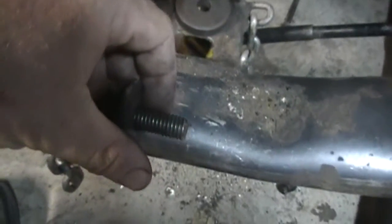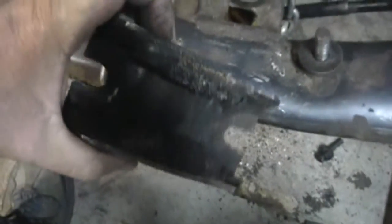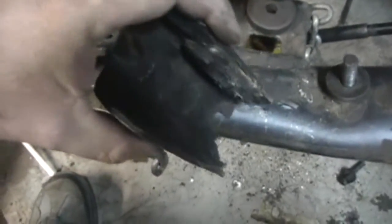The stock stud is less than a half inch diameter, but I go to a half-inch diameter button bolt and weld the nut to the inside. Basically all I do is take a torch and a putty knife, heat that up and pick it out. Or if you're sitting around the bonfire at night and it's legal in your area, just toss it in the edge of the fire where you can find it later, and you'll end up with something like this — nicely cleaned out. Take a wire brush to it and it's perfect.